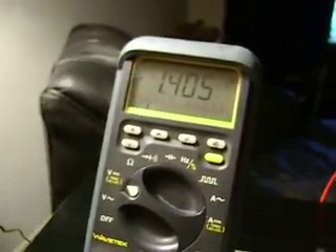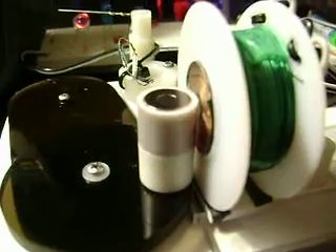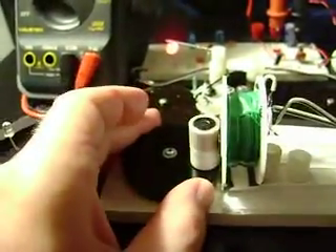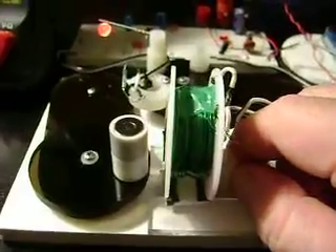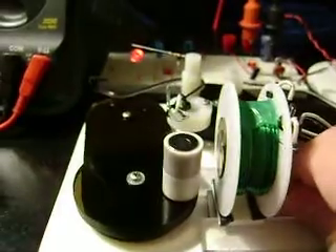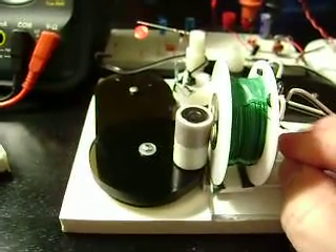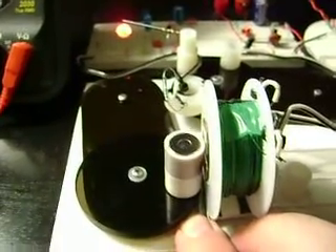She runs good. I'm real happy I got the stator from the whip mag to work with it. It took me a while to get it going. I had a lot of that wobbling stuff and I was thinking it wasn't going to work. But she's working pretty good. Neat stuff. All this stuff is movable. This is movable. It makes it nice because you could leave the switch how it's reacting to the magnet and move the coil away only, and it won't affect the switching. But if you move just the magnet, the switching is affected. Even with some drag on there, she's pulling. It's got some torque.